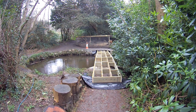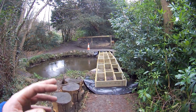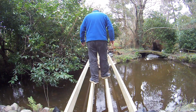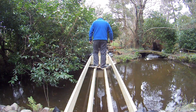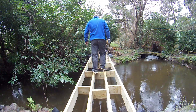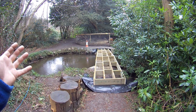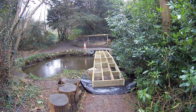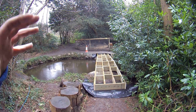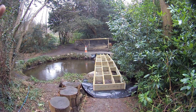That's all the noggins in and it's all clamped together, working as one. Hopefully it shows in this video — before, you could see the beams twisting, each one moving on its own. But after the noggins are in, as I walk across it all moves as one. There's still movement — it's timber, it's going to move — but it doesn't flex anywhere near as much. Once I've got the deck boards and the handrails on, that's going to be even better.